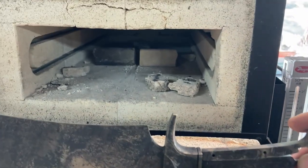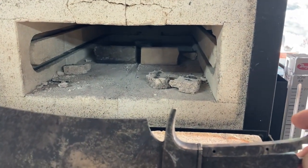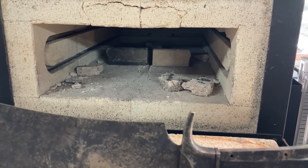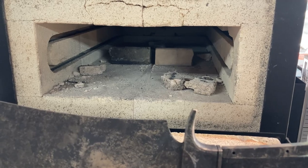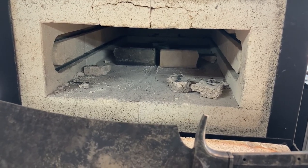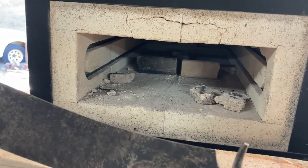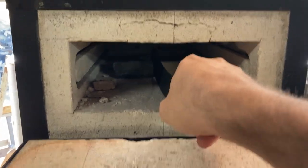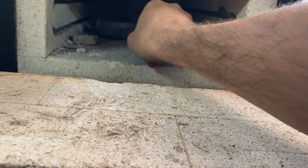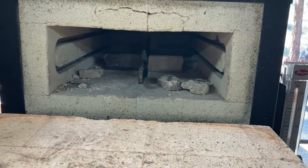Anyway, now we're going in for a 375 degree temper, and then we'll pull out and Rockwell test it. I'd like to get to 59 on this, and if we're still too high, then the last temper I'll go to like 400, but we'll see. And we're in.